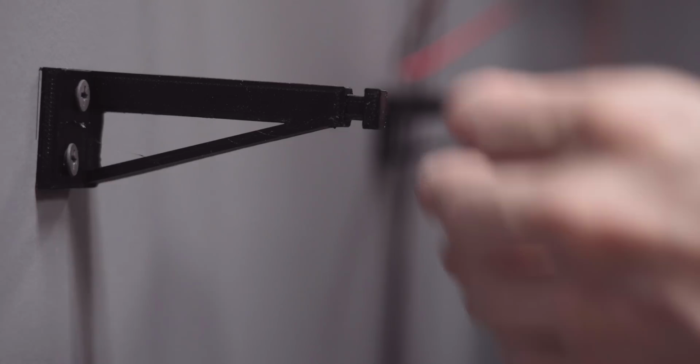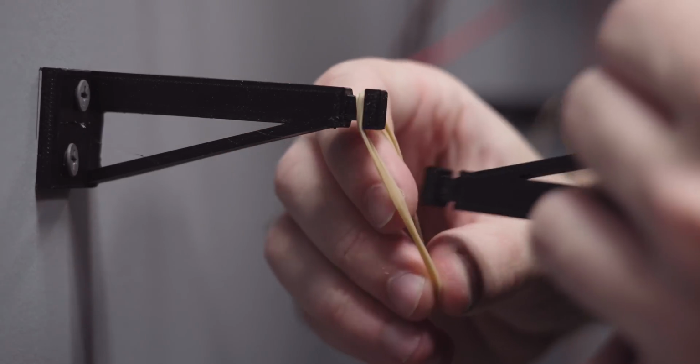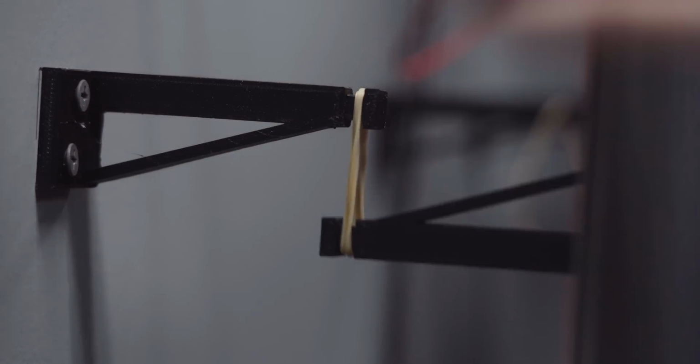On top of that, I started noticing that some of these panels would resonate at the same frequencies. So I tightened some of the rubber bands more on other panels than others, and that pretty much eliminated the issue. What I ended up with is a speaker that definitely needed DSP to sound good, but it also had a very unique sound. Something that exciters generally struggle with is extension on the treble and the bass.